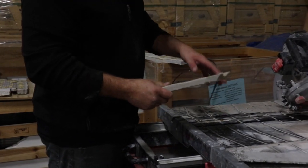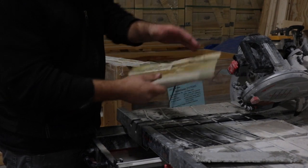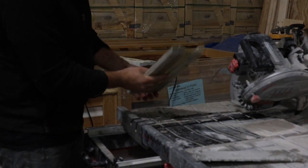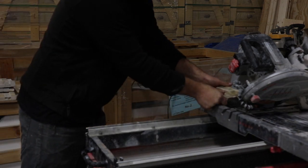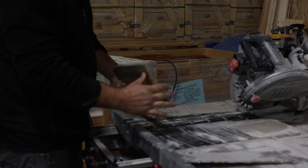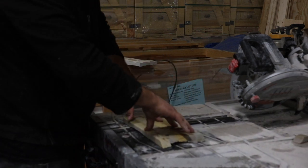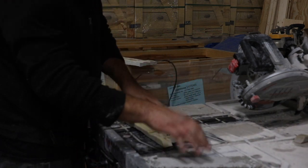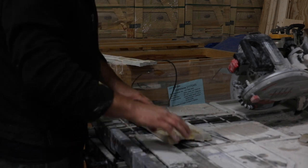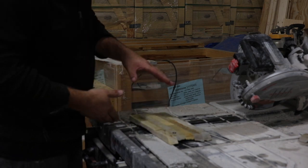So the last cut I did, you might have noticed that I had the face of the piece down. The reason I had the face of the piece down is because if I would have had the face of the piece out, I would have had it almost all the way through, and sometimes you get hung up over here. So face down sometimes gives you a little wobble. So I shimmed in a piece of cement board to make sure that the whole product had a nice, flat, even cut.